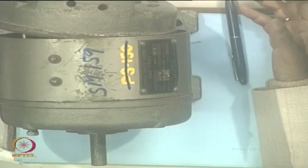And today we will start learning about single phase induction motors, because these are the ones which are used in large numbers. Maybe this almost is the bulk of the special machine category. And they are nothing but 3-phase induction motors in principle, but with some variations as it contains only limited, fewer windings than the 3-phase, and also they operate with single phase. The single phase induction motors are so called because they operate with single phase supply, not that they have single phase windings per se.